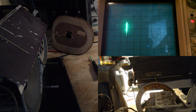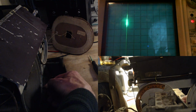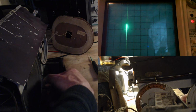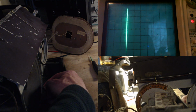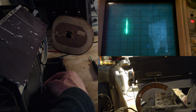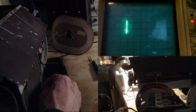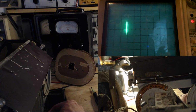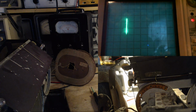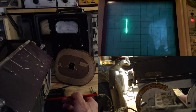Okay, 1400 and 1400 down here. Where are you? There it is. Okay, is that 27? 27. Gotta make sure this is right on the money here. I think the meter's a better option. Just right there. Okay, perfectly tuned. Now I'll try that antenna capacitor. Okay, I'm ready. Watching the meter.